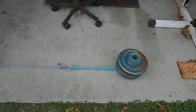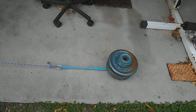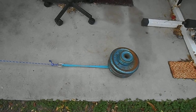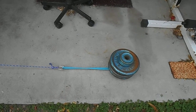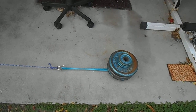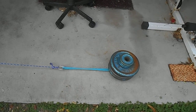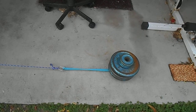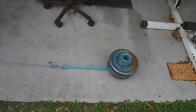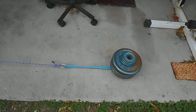I found it's very difficult when you're pulling on something. Your gauge is moving all over the place, whether it be digital or a dial. It's going to be waving backwards and forwards. The only way you can get a really precise measurement is to put a constant force on it. So what I do is find out what the extension is on this, and then make an apparatus up where I can pull it. Say it'd just be a board with an attachment at one end and a nice long vice type thread that winds fairly quickly, and put the same extension and find out exactly how many pounds of force is actually pulling it along.